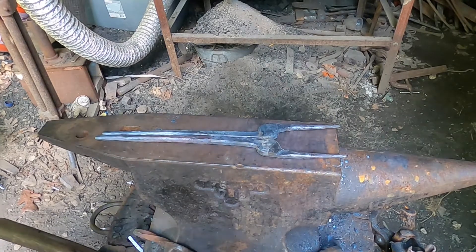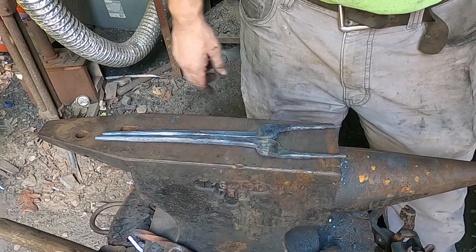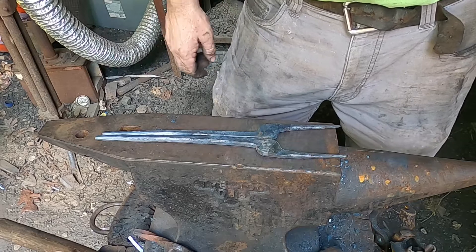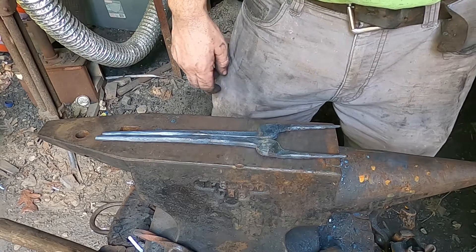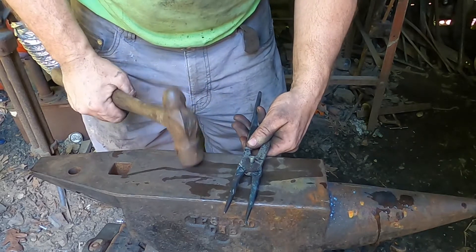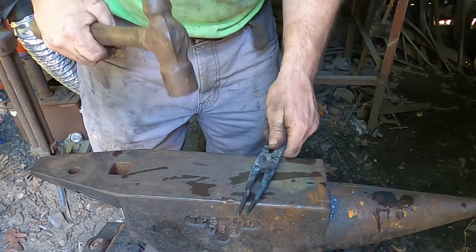There are the two halves. I'm going to let them cool now. There are some things not covered in any video I watched about getting these tong jaws lined up — I'll figure it out. Hopefully those reins are going to be comfortable. I might have to grind them a little bit if they're not. I'm going to let them cool, drill a hole in them, and get ready to set the rivet. I don't have a fancy rivet header — we're just going to drive the rivet down and finish the tongs up after that.